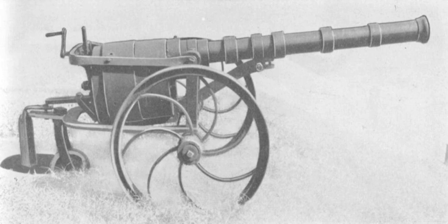The cylinders of the revolving cannon were fired using percussion caps. The cap was struck by a large spring-actuated striker. The cannon employed a screw mechanism which pushed the cylinder forward when it was in position, reducing the gap between the cylinder and the barrel, which significantly reduced gas leakage during firing. A lever attached to a ratcheting mechanism was used to rotate the cylinder, and a spring-loaded cog would slip into recesses in the cylinder, holding it in the correct position for firing.